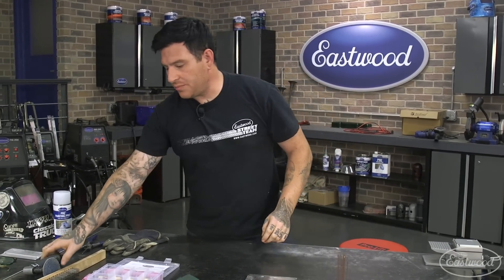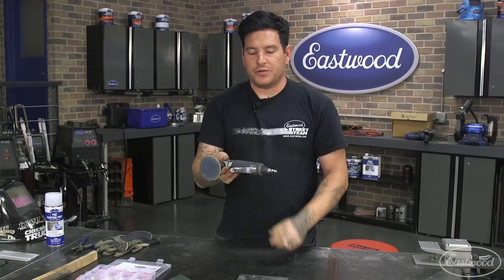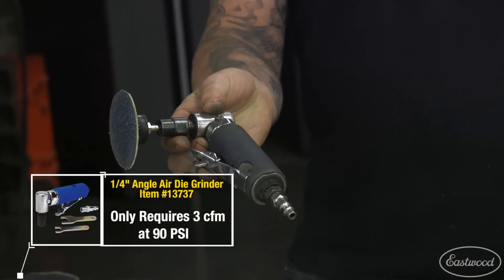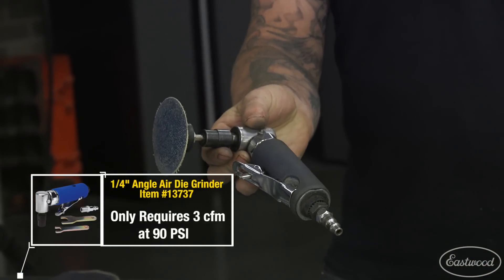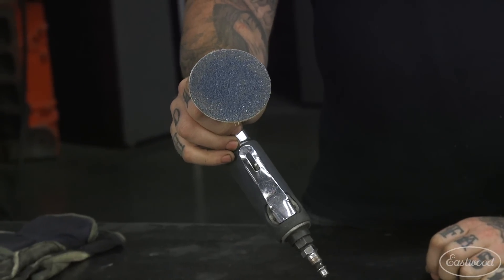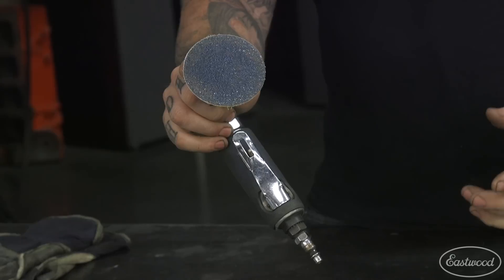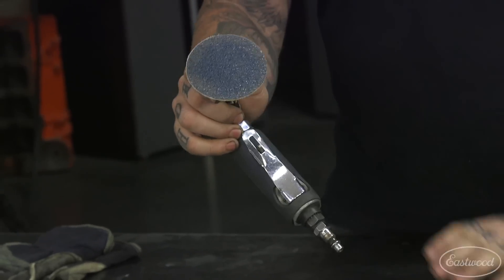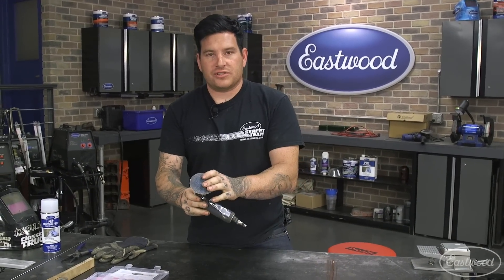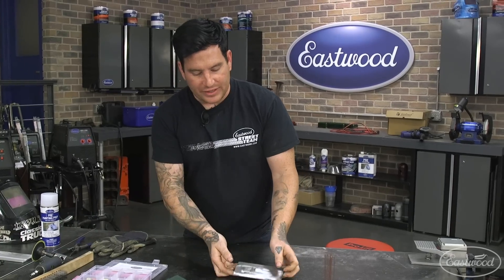To save you watching me grind for ages, I've already prepped these ahead of time. What I use is one of these little die grinders. A lot of you probably have them in your toolbox. I put one of these 36 grit sanding discs on there and buzz over my part. If I'm doing sheet metal or something thin, I probably won't go this aggressive — I might use a DA sander — but for what we're doing today, I buzzed over it with the 36 grit, got all the contaminants off, got it down to bare metal.